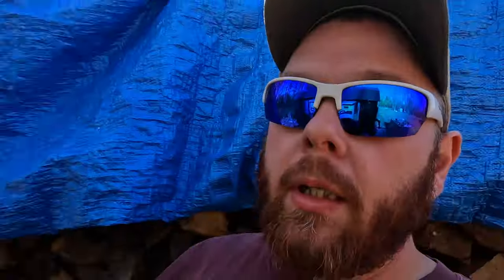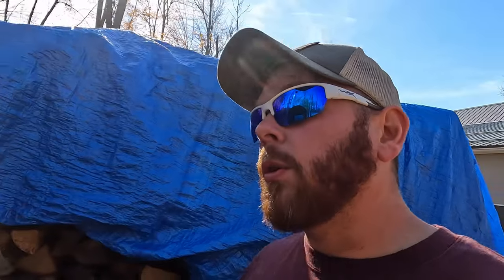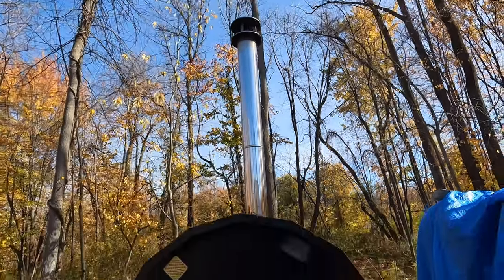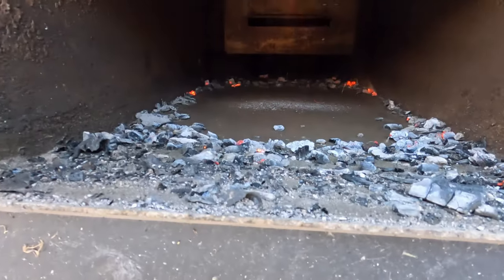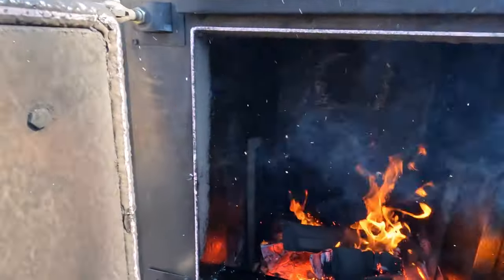We're back out at the boiler and we are making hot water. Fire temperature is 736°F and the water temperature is 149°F — that's pretty good. The reaction chamber — I don't expect really crazy temperatures just yet. The boiler works better once it gets some ash built up and a decent coal bed, then it'll really start to function as it's supposed to. 750°F down below. Nothing coming out of the chimney up there — just a little heat shimmer, no smoke at all. We can open it up and take a look. There's the gasification chamber — you can see a little bit of flame shooting down, but nothing major. We'll get more footage of that later in the year once it's running at the temperatures you're looking for.